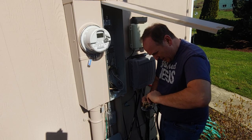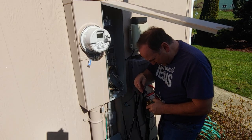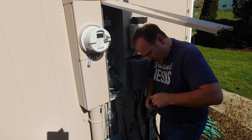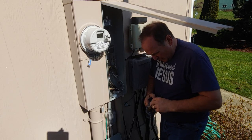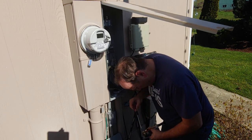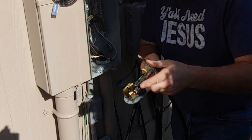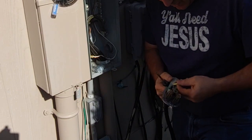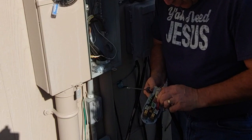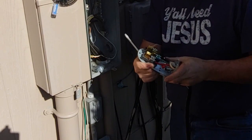Bend them up a little bit. Ready to tighten the first one down — tighten the ground down first. Green is for ground, white is for ground as well, or neutral. Red and black for hot. So we've got black, green, and red. We really don't want this other one touching anything, so we're going to shove it through here and tape it later or cut it off. But I'd like to keep it because if I later on decide I need a four gang, then I've got it.